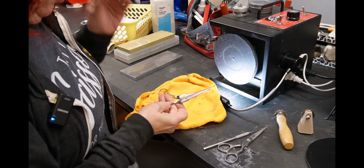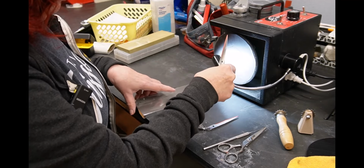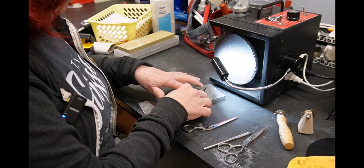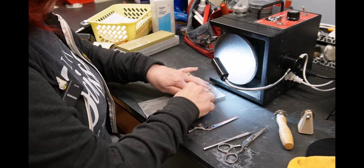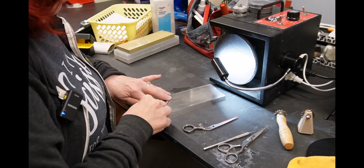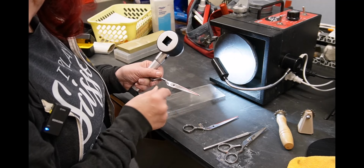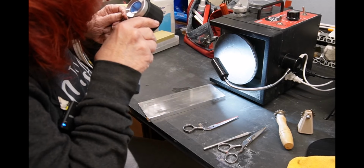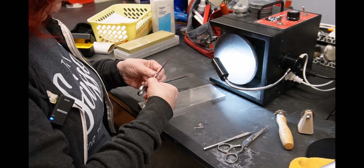So normally I wouldn't be this aggressive with these shears. I've colored in the edges. And I'm going to start out on this 1200 grit diamond stone, because I've got to get it beyond that nick at the tip. Might have to shorten it to get that. I don't know. So what I'm looking for is to see if the silver where I've removed along the ride line is beyond where that tip is, where that crescent is, as he called it. I'd call it a nick, but crescent, I like the crescent.